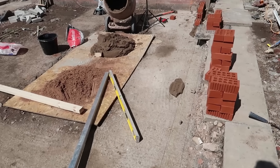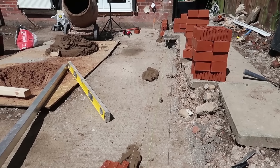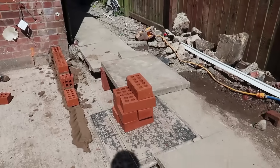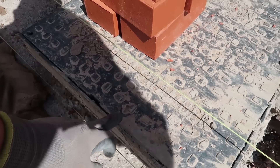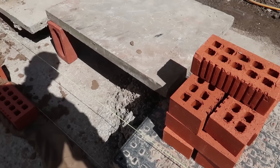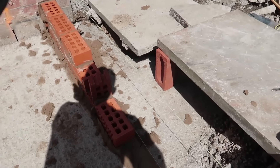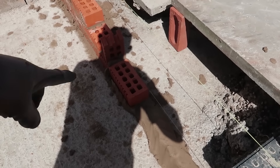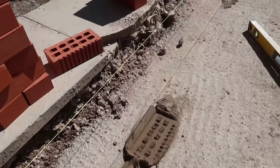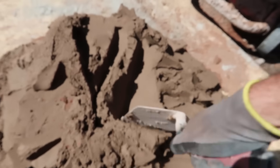We've set up now. The first thing you should do is strike a line through the side of your house, so you're working with the gable plane of your house and you can work off that. We've had to come in 100mm because of this grid here — it was going to be too much hassle to move it, it was in so much concrete. The building inspector said to move it over a bit, which is why they had to bridge it when piling. It's quite tight, so I'm going to have to put the first bed really tight and then work with that. We've got three courses to work with. This mix is three to one — three sand to one cement — while in the footings you want a stronger mix.